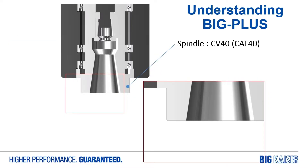Big Plus was a fairly simple concept. Back in 1992, Big Daishowa Seiki, our parent company in Japan, had an idea to improve the existing steep taper spindles. On a steep taper machine, there's a theoretical plane called gauge line. On a CAT 40 tool, it's where the cone of that spindle becomes exactly an inch and three-quarter. As part of the standard, the position of that face is very loosely toleranced, so plus or minus about eight thou.